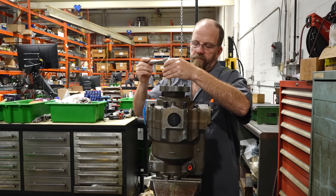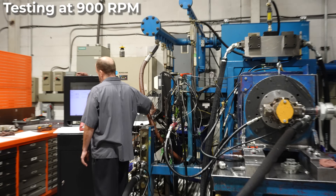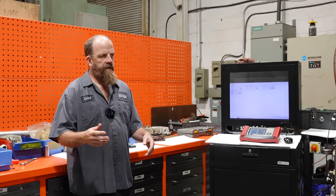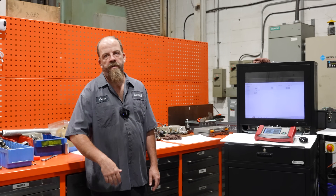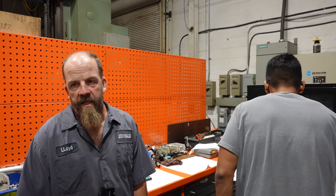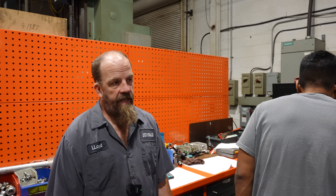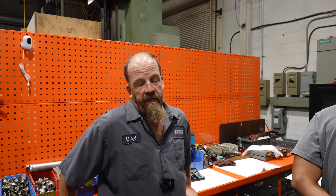For basics, inside the guts there's nothing you can see — nothing inside that is causing any kind of a failure. The customer was saying that it was working but it wouldn't start up properly; they had to do a certain procedure and everything worked fine. We put it on our bench after we inspected everything. Right away, no issues — went to full pressure. We backed out the remote to set it at different points. Then I remembered it's a warranty, so I better run it at 1800 RPM just to make sure everything is 100%. And then when we fired it up, it didn't work at 1800. So the customer might be running it at straight 1800 RPM and that's what's causing the issue. Usually, if you're going to have an issue or a failure, nine times out of ten it'll fail at 900 before it'll fail at 1800.